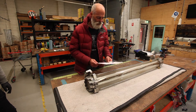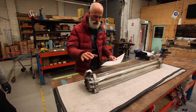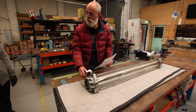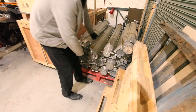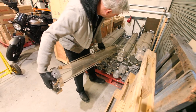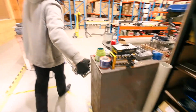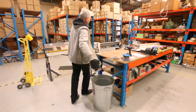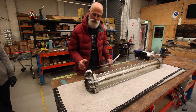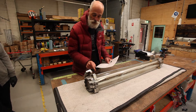We have an order this morning — over the weekend — for an explosion-proof ship light. These are lights that come out of ships, probably 30 to 40 years old. They're made of solid cast aluminium, essentially for ships that carry volatile liquid gas, so that when the light turns on, a spark can't ignite and blow the ship up. They're really well sealed, really solid, with very thick glass and very strong construction — but what they do have is fluorescent tubes.